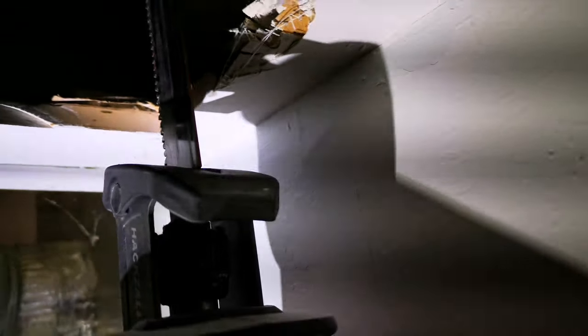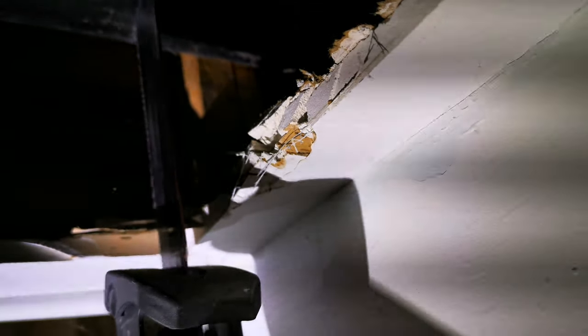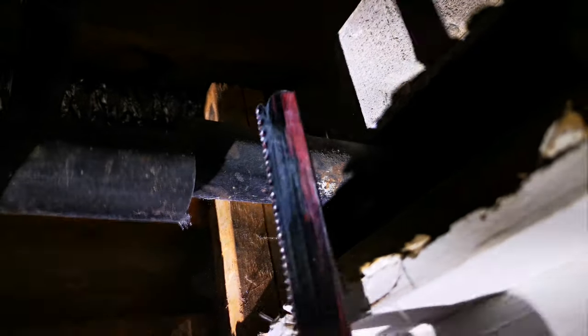Remember, don't push hard — let the blade do its job. See how my blade teeth are still in perfect condition? Well, the paint's gone, but the blade teeth are in very good condition. As long as you don't push hard, it will cut the pipes, not kill the blade. Go smooth. Clean cut. I'm going to cut the other side and bring down this section of the pipe and just keep cutting.